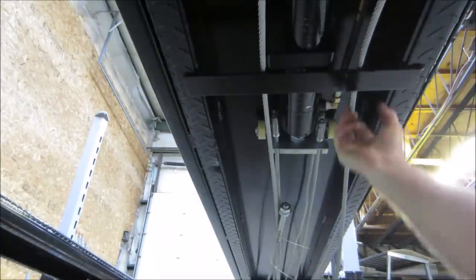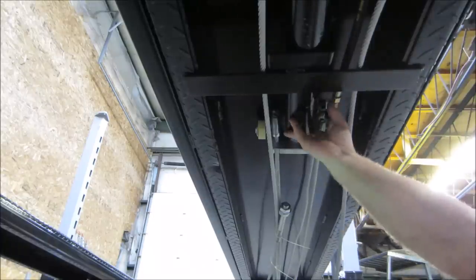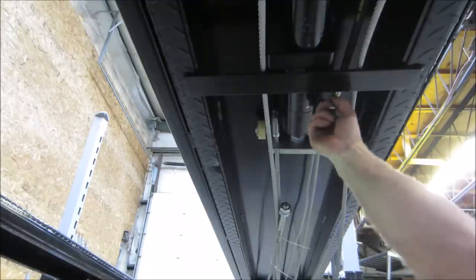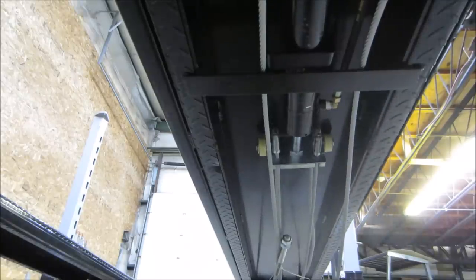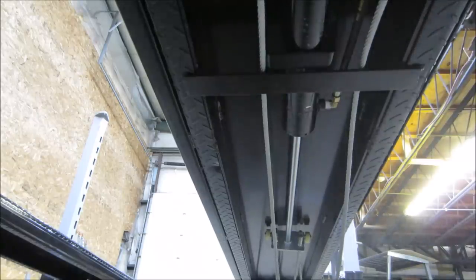This has a single-sided cylinder. Fluid goes down this side and it would collapse the cylinder because this would be the all the way up position. So the other end of the cylinder where this connection is open, I'm gonna try pushing some air in there. It should allow that cylinder to pop out. Should. See what happens. That's enough, but we'll start with that.